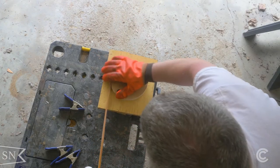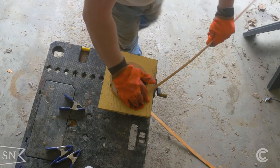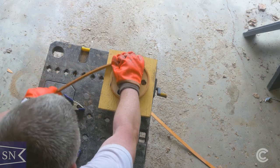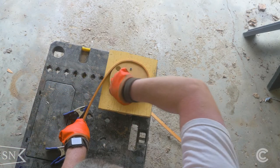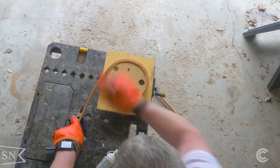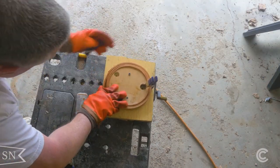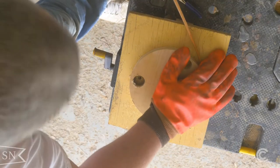That should have been enough for that thickness of wood. I was already aware of one problem I was facing — it's best to use wood that hasn't been kiln dried because the lignin is still present and allows you to bend it. Once the wood has been kiln dried, that lignin is pretty well set. So I was concerned about how brittle the wood was going to be even if I steamed it for a good long time. I pulled the first piece out, put it in the form, and started bending it. The wood did go around the form but I could feel it really resisting and almost on the verge of breaking — but I did manage to get one decent hoop out of it.